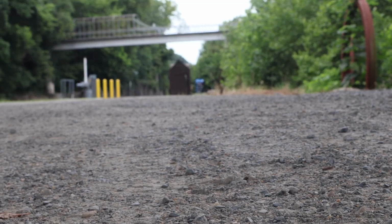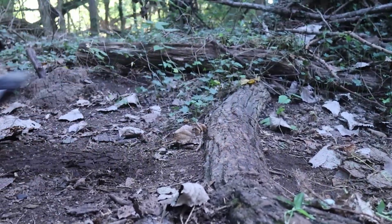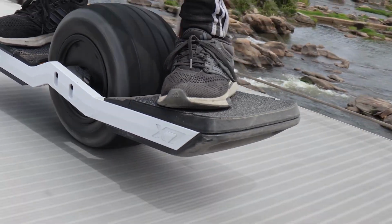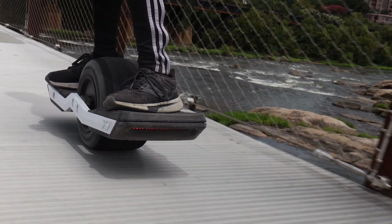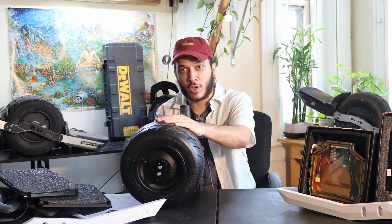So much that it's the only motor I can now stomach riding. This 2,000 to 4,000 watt motor with more than 50 Newton meters of torque in a free spin of over 60 miles per hour or 100 kilometers per hour with field weakening. This motor is an absolute beast that most of the controllers would struggle to fully utilize without ever overheating. I'm looking at you.